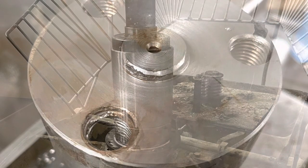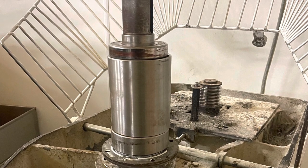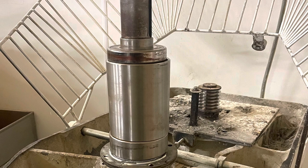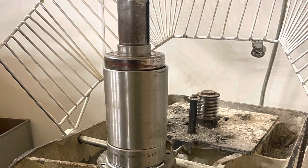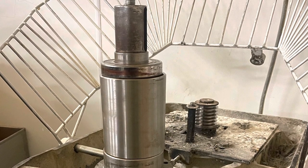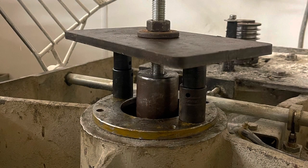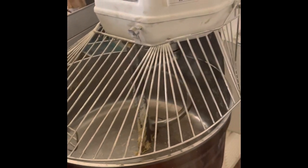No need for a helicoil with this one. The shaft is re-assembled and just sitting on top of the machine. The shafts have to be assembled up through the bottom of the machine, and then there's a bearing cap that sits under the bearing that gets bolted to the machine to stop the shaft from coming back out. You can jack the shafts up or use some threaded rod to pull them up inside the machine — that's what I elected to do with this one. A bit of M16 threaded rod, a couple of standoffs and a plate with a hole in it, and you use a nut to pull the shaft up. It's a slow process but it's controlled and you can make sure everything's going in nice and straight. Here it is with the big pulley back on, running nice and free, and the machine is back in working order 24 hours after we took it apart.